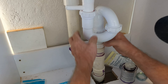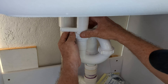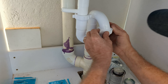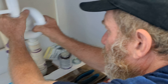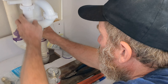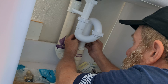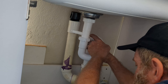I came with PVC, then went to my straight pipe and to my S-trap kit. You want to make sure everything goes in without any stress or strain — get everything a little loose and in place before tightening them all down collectively, because these fittings are not super strong but they do adjust. There's a little flexibility in PVC whereas stainless steel or a non-flexible surface wouldn't have that. This trap holds water, which stops gas from your septic system from coming into the room and making your bathroom smell bad.